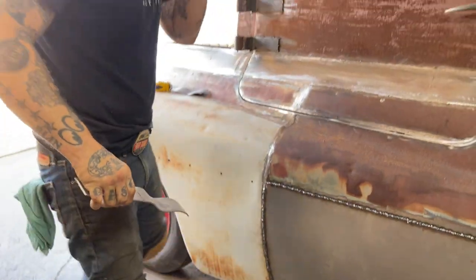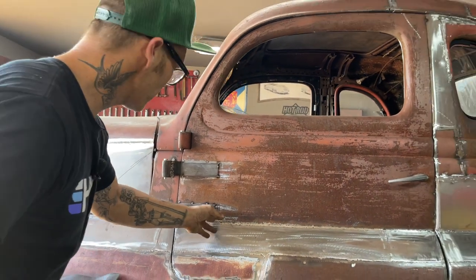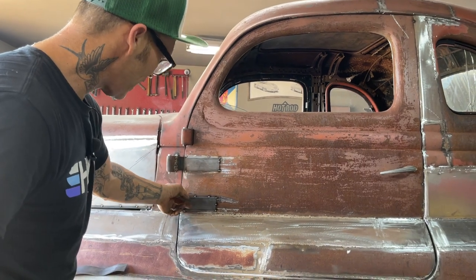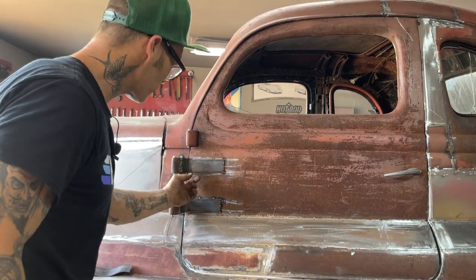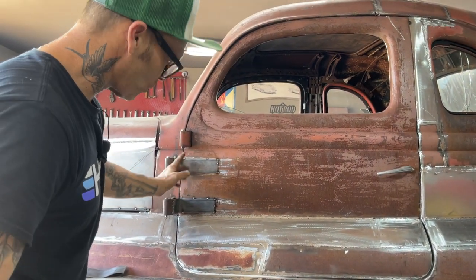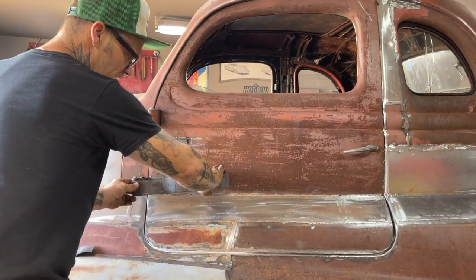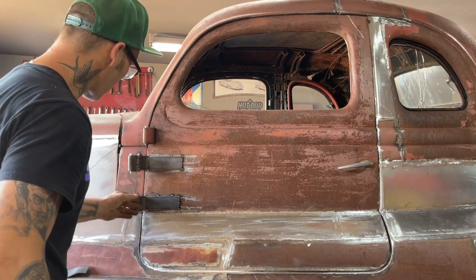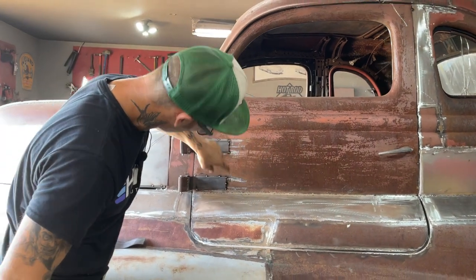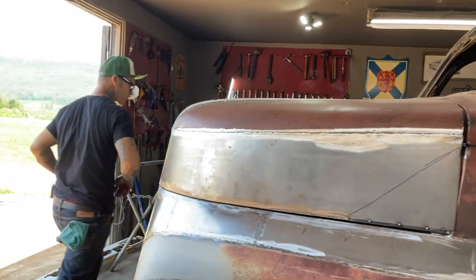And the reason why I'm saying that, as you look at this, I kept thinking, why does this look further ahead than this one when they're the same length? Well, the door is further back there, and the door's ahead on this one, so when I made them come up to the edge where I bent it, two inch, this one pulled ahead a little bit because of the door, and that one came back a little bit because the door's angled like this. That's what I was thinking. As I make these both the same, they're obviously not going to hit on the truck the same, so I'm going to want to make one a little longer or a little shorter than the other so they come in line together. I'm going to make it come down here so they look parallel with each other. I'm not going to set one off shorter than the other with the door.